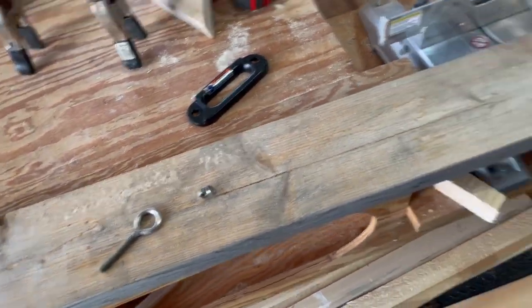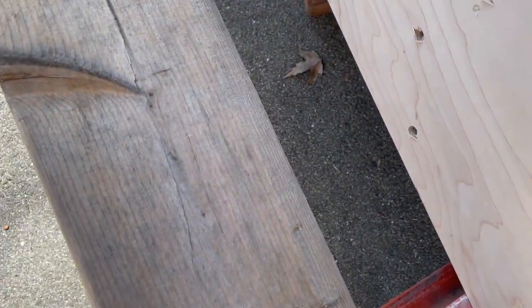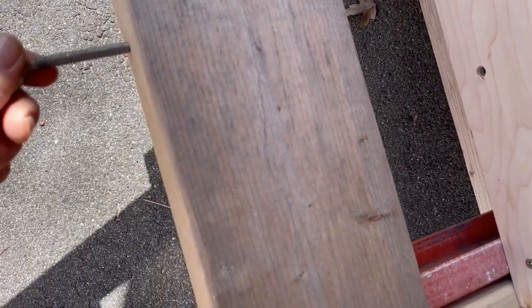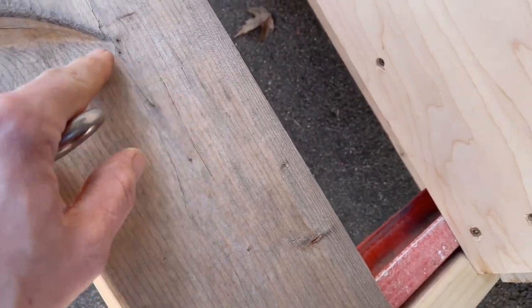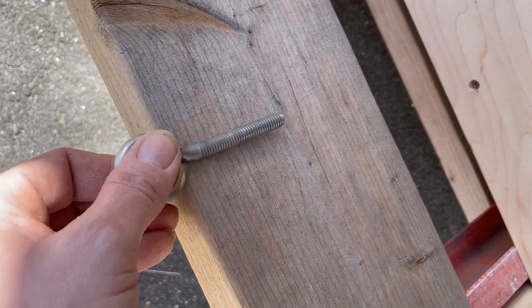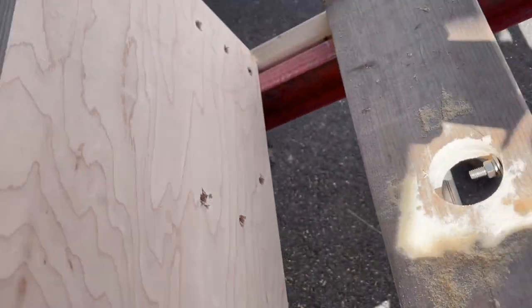So I'm trying to figure out how to hook the hook of the winch with this bad boy here to my sled. This guy, let's see if he fits on here. And it will. So I'm wondering if I take a hole saw and do a hole right here and a hole up here, with the hole here, I can bolt this dead center so there's a place for the hook. So the winch is going to be down mounted behind. I'll have the cable running up and around and down to this hook. There we go. So all I need to do is put a hole with a hole saw right in here, have this come down, washer it, nut it, and that should hold for the work we're doing. Oh, in theory.